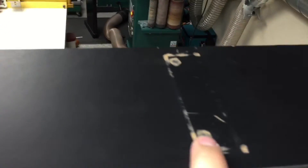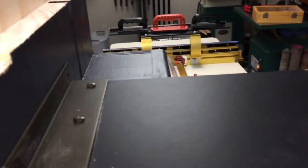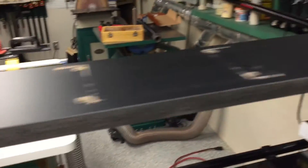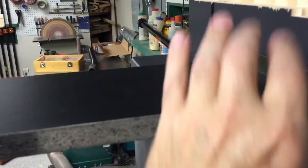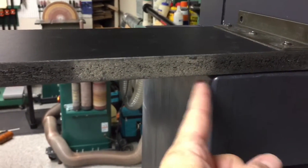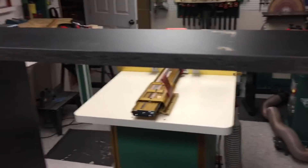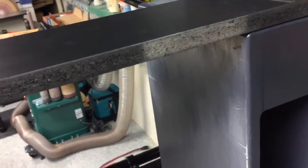I took home the center brace that goes between the legs on the Clavinova — it also holds down the pedals — but what I'm using it for is to find the exact distance between where the legs should be, since this would be the length of the Clavinova on the underside. I'm going to measure the inside measurements of both my new wider legs and cut the board down to that measurement.